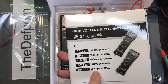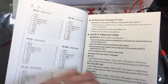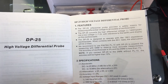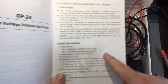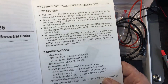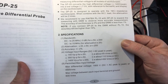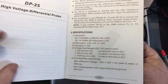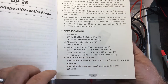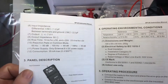You can see the various attenuation options: up to 20 kilovolts at 20 MHz, or the highest frequency option is 100 MHz at 7kV. The DP25 is 25 MHz, 3dB. Attenuation options are 50x or 200x, or 15 MHz at 20x. Accuracy is about 2%, which is not too bad. Max differential voltage is 450 volts RMS, and max voltage between each input terminal and ground is 600 volts RMS — so you have to watch out for that.